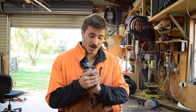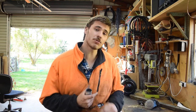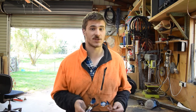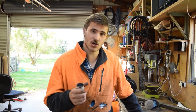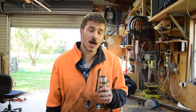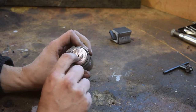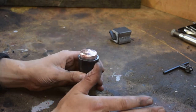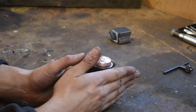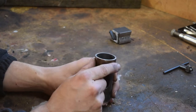We've had some success. Was it easy? Not at all. It melted the steel crucible, which was amazing — also the steel lining of the furnace, that's not a thing anymore. My only success was using my little graphite crucible — not designed for this, but it worked. Using coal, the hairdryer, and my graphite crucible, we got a hopefully successful copper casting. Look at that — that is fantastic. Now it does have a little bit of a porous bubble in the middle, but I'm not concerned. As soon as you use this a couple of times, it's going to mushroom out and flatten. Let's work on the other side and start getting this leather thing sorted out.